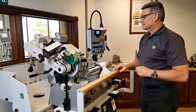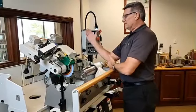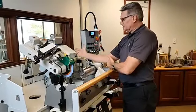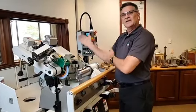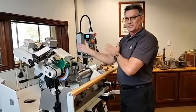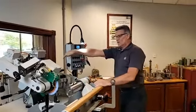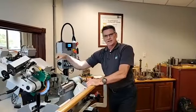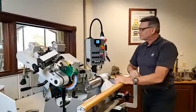So again, time consuming. Then not if, but when, we need to change the back clearance angle for a jointed machine or a non-jointed machine, even in the process between rough and finish grind, we have to change that angle. So that operator would have to walk around the back side of the machine and again run a ratcheting handle to get those angles up and down.